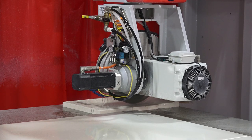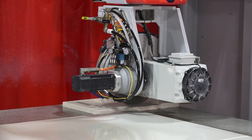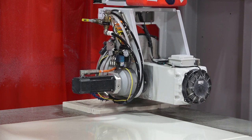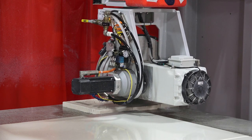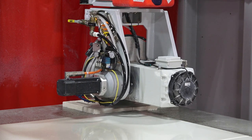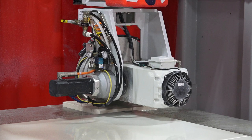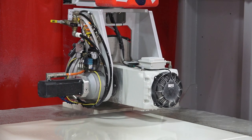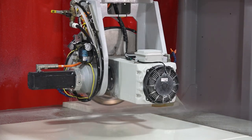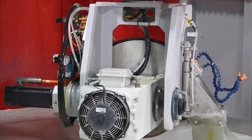One of the things with processing this material is the chance of blade glaze-over. What John has done is place a piece of quartz up in the corner. We're going to run the blade through that a couple of times to ensure those diamonds stay open and reduce the chance of blade glazing. There's room on the table — it's simple to program in, and it's good practice.